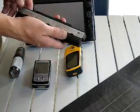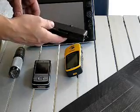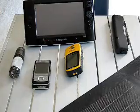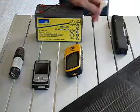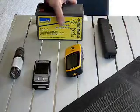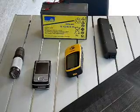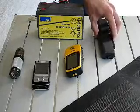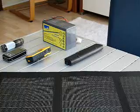It's very lightweight with a high power-to-weight ratio. Compare that to some old technology — this is a lead acid battery, a smaller version of something you'd find in a car, and it's about the same capacity as the lithium ion battery. This stores about 70 watt hours of energy at 12 volt output, but weighs two and a half kilos. However, there are reasons why we might want to use this over the lithium ion.